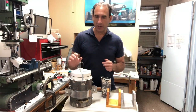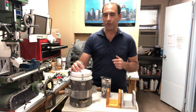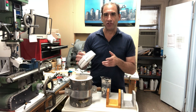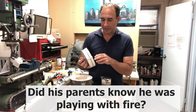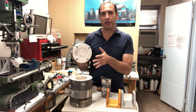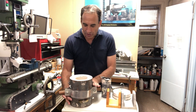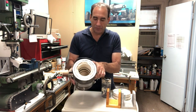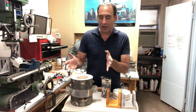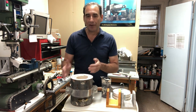This is the furnace that I'm going to use. I actually created this in 10th grade. I started experimenting with furnaces just made out of plaster of Paris. This is the top, made out of plaster of Paris, but it dries out very quickly and starts cracking. Later I learned that by adding a layer of fire clay, it's less likely to crack, and that helps protect the plaster of Paris.